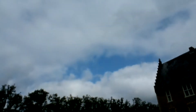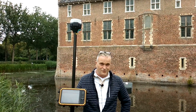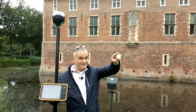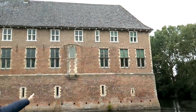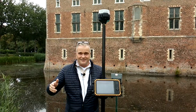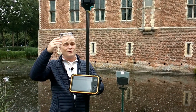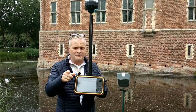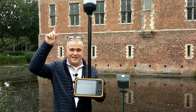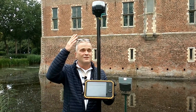There's the satellite signal — we have satellites there and there and there and there. But before the signal comes from the satellite all the way up to my GNSS receiver, it has a lot of obstacles. For example, those white things in the sky — the clouds — are an obstacle. And when it reaches a little bit further, we have trees, buildings like the castle in the background, electrical fences, electrical lines. Anything that's an obstacle. The first signal from the lowest satellite comes from 20,200 kilometers, so it needs to travel a long, long distance before it reaches my GNSS receiver.